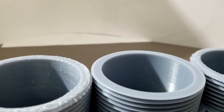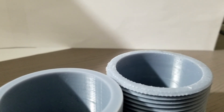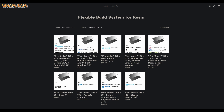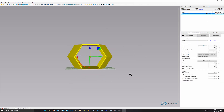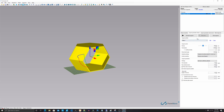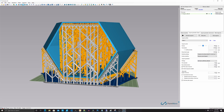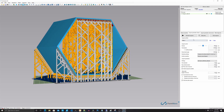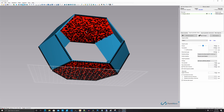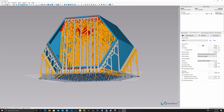The first layer after supports flexes inside the resin as it moves — its shape cannot be 100% predicted even with supports; it's like a sheet in the wind. A flex plate helps because the absolute first layer on the base plate doesn't need supports, becoming your only first layer. Without a flex plate, light also seeps through that first layer and cures resin behind it, making a predictable flat layer impossible. As subsequent layers cure, they add light to prior layers, hardening any misaligned shapes.